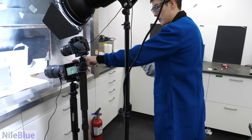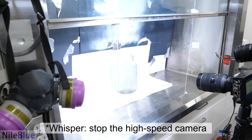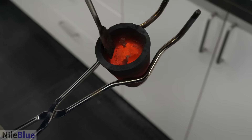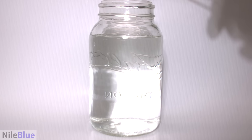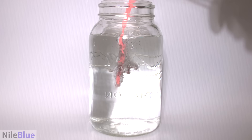Okay, let's go! One, two — pour! That was surprisingly tame — it didn't explode. So what's happening is the red-hot metal hits the water and immediately forms a pocket of water vapor around it, which prevents other water from hitting it. But right at the bottom it explodes, and that explosion travels up.